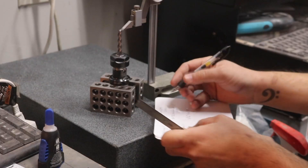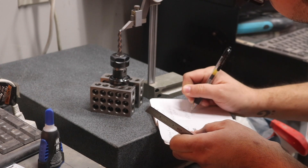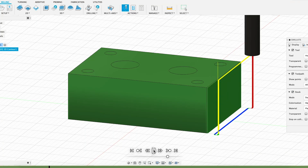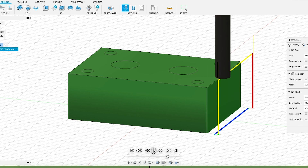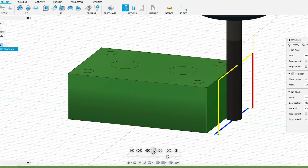So now we can start working on our programming for what we're going to do here — a lot of simple operations. I've got this really long 5/16ths end mill that I'm going to use to clean up that saw cut side. And even though when I'm programming it right now it seems like a really good idea, this is really kind of too spindly of an end mill for this long and deep of a cut with this much stick out. I'm using 2D contour here to just take a full depth of cut pass, which while programming it I think is a really good idea, but once we send it to the milling machine I think I'm going to be proven wrong. I added way too many step overs, and we got a really, really fine cut, and I think that's going to cause chatter. Let's just go ahead and test that out.